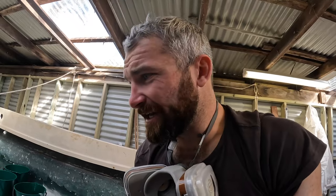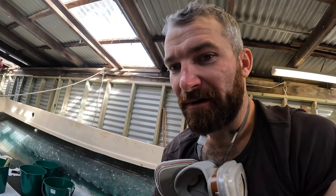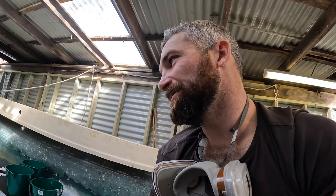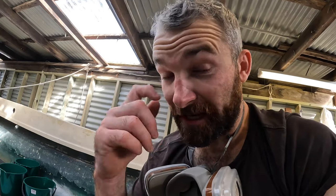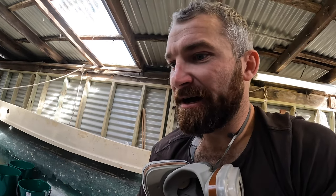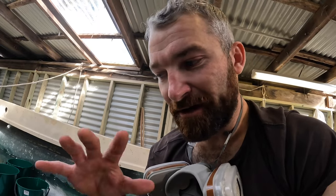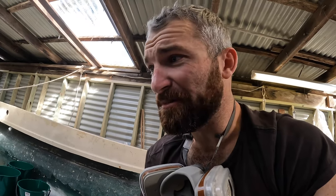Was a little bit of a disaster. Trying to do that fold halfway along is definitely not the right way to do it, guys. It was very wishful thinking on my behalf that that's how it would work, but once you wet out one side and then you try to fold the other side back over, what it does is it picks up the glass and the chop strand mat that's already wet out, it just does not want to form where it was previous to you moving it.